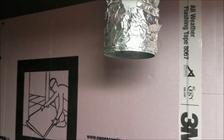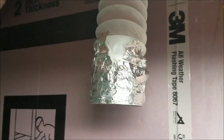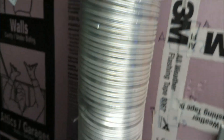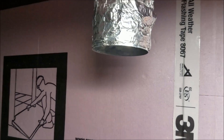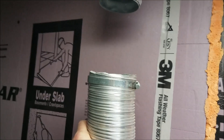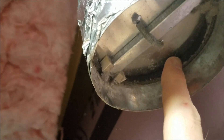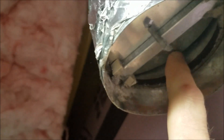The deflector goes between your dryer outlet and the outside world — you cut it and place it right in there. I also recommend getting a damper in here. If this isn't closed, you can feel cold air just basically rushing in. The louvers on outside vents really don't do anything — they just stop insects from coming in. You want something that's completely sealed, which this is.